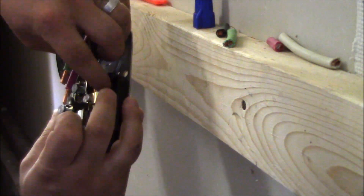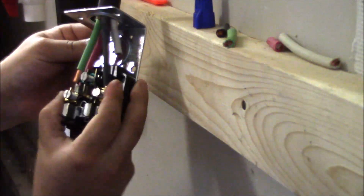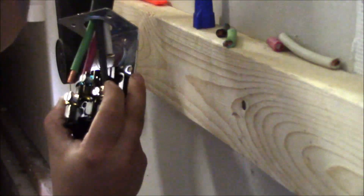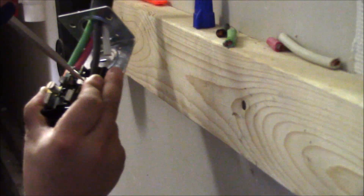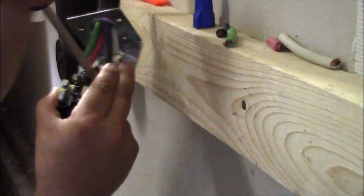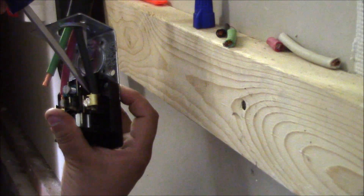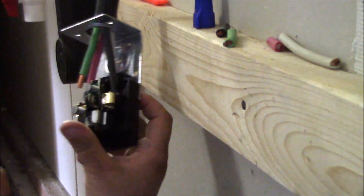The plug has these nice terminals — it can be a pain sometimes to get the wires in there, but they are pretty nice as far as how they go in and then how the set screw with the flathead goes in and basically clamps the wire down. It's a pretty good system. Another good reason why you don't want an excessively long stripped wire is that if it's stripped too far back, there's a remote chance it can arc back to the ground — and that would be a bad thing.